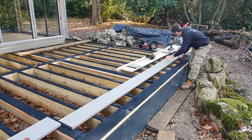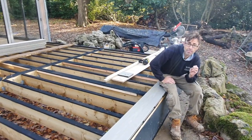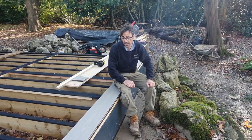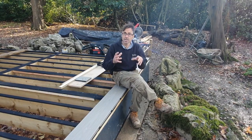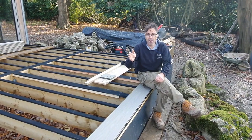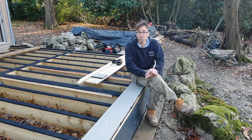The clips are on — this is the first board. It's a matter of pulling it over to the clip, slotting it in just like that, and following my line on the inside. Now, these composite boards should be really nice and true if they've been stored correctly, but if they've been standing around and not stacked correctly there may be some movement, so don't rely on any material being dead straight. It's always best to check it with a line. With deck boards where you've got a space, you can pull a line through every fourth course if you want to gauge it out, so if you're getting some variation you can just keep coming back to where you should be.